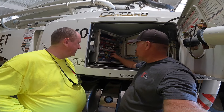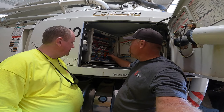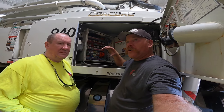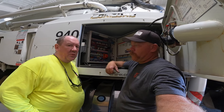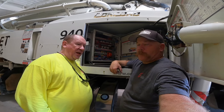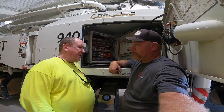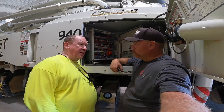Like I said, this is kind of a rat's nest but we'll clean it up. We've got a couple of relays here — the main one is this delay relay. It's got settings on the back so you can time it. Make sure I get this right: you can time it so that when you turn your pump on, the cuff deflates before the pump starts pumping. So we want the air cuff to deflate before we start pumping through the air cuff — it'll deflate, probably about five seconds or so, and we can adjust that through the timer.